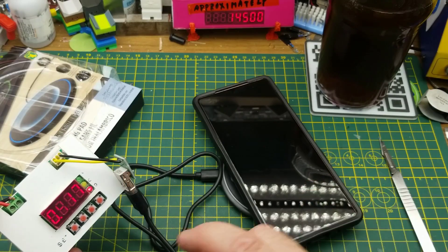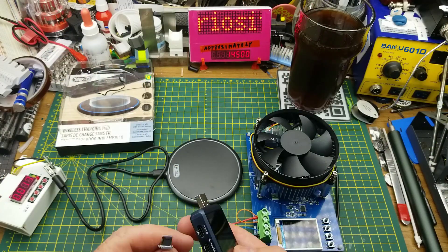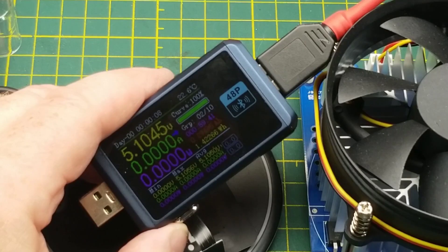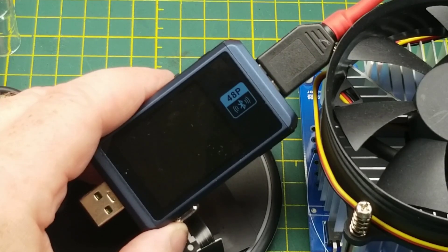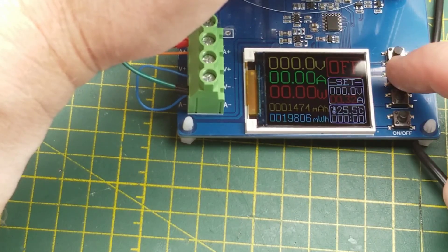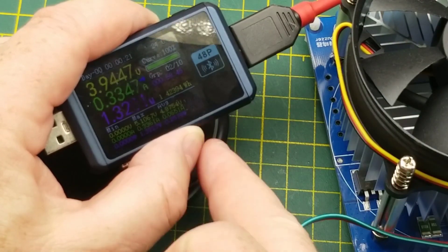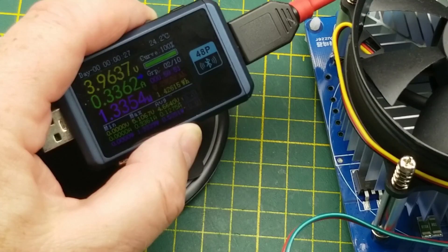It's dropped back to half an amp already — I guess because the phone's not horribly discharged, that makes sense. Let's try and push it a little harder with this little charging pad. It did eventually wake up. From the load over here, trying to draw one amp sucked it right down to nothing. Pulling the load down to 320 milliamps it'll do that, but it is really dragging the voltage down.